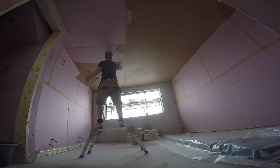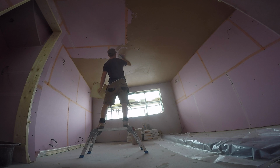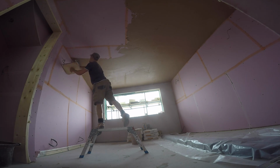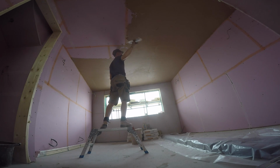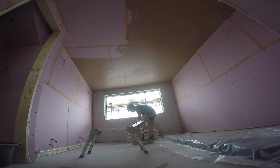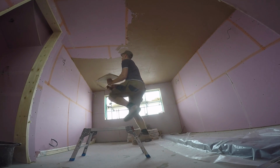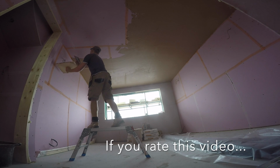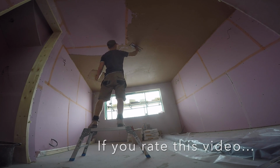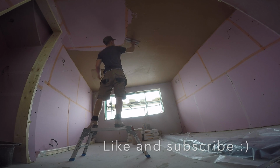As you can see now, there's been progress made working the final section, and you can see where I'm meeting in the middle. You can trowel your lines out, and there's no real joins, so it's alright. Again, keeping it smooth, keeping it even, but it comes with time. You'll find the more you plaster, the easier it'll be to get plaster on without leaving any trowel marks behind.